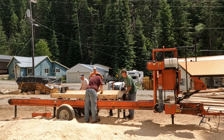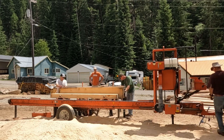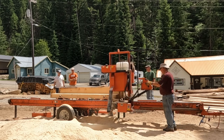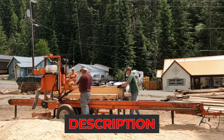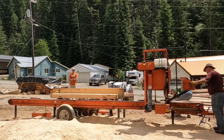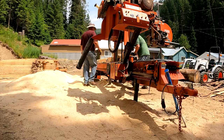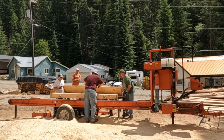Once we got that milled down enough to get the slabs up, look at how big those slabs were — they were over 12 inches. Those are big slabs. This customer didn't really want a whole lot of live edge, so we're going to edge these down into 1x6s. I always do that up against a cant or a couple boards against the side supports — it makes it more stable and allows you to get them nice and straight up and down so you can edge them out. Once you take the tops off and get them flat, you just flip them all over, get them into position again, and mill them down some more.